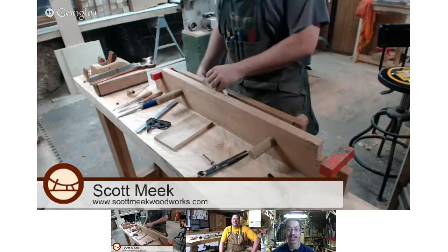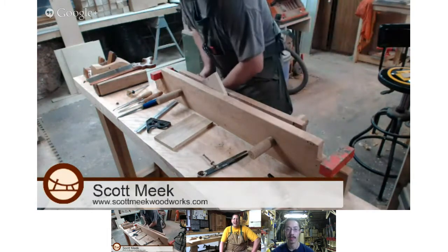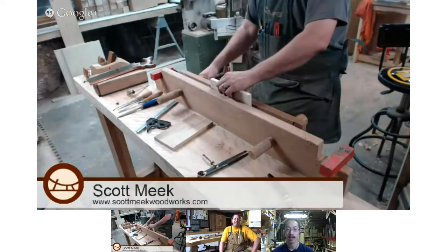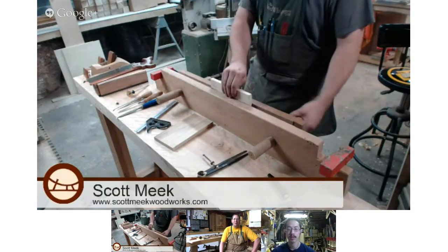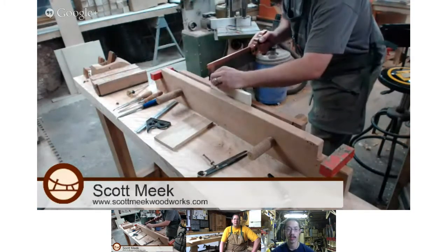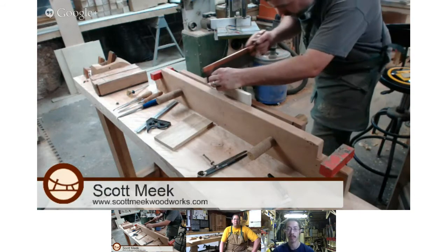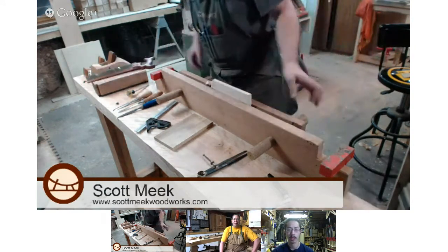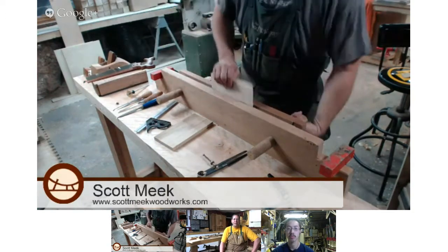They provide a fret saw now, too, don't they? Yes. Now, the very first year they did this, they didn't have that. Enough people complained. Which is good, because I didn't used to bother with a fret saw back then, and my technique has changed to use them now. Yeah, saves on chisel wear. It does make it quick, too. Especially for the pin boards. I don't even use a mallet anymore, because you just cut right to the line and tear it away. Wow.